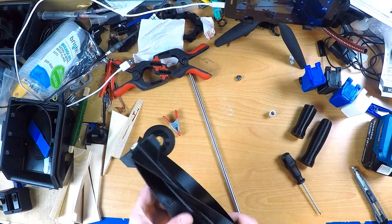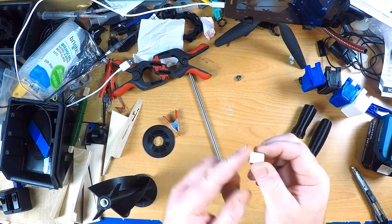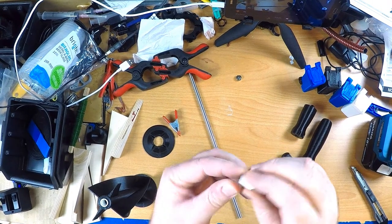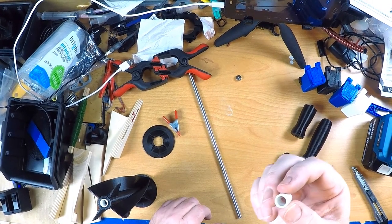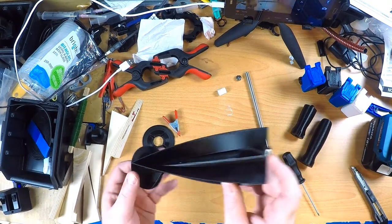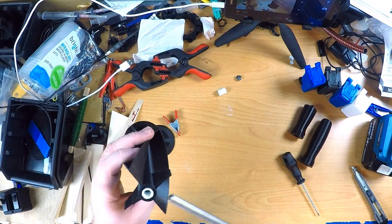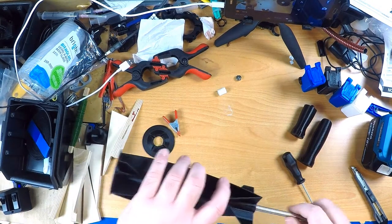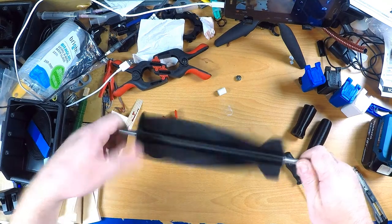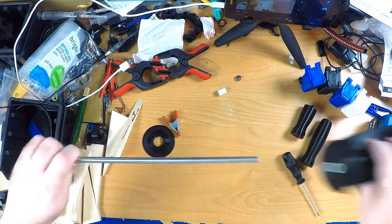Okay. I've prepared the parts. I've cut a couple of these bushings off of a longer plastic bar. It feels kind of slippery, so this seemed to me to be the ideal bushing material. I press fit it into the PLA part right here, and I've used the drill to drill it to size. And now the bar fits the shaft and it turns relatively freely.